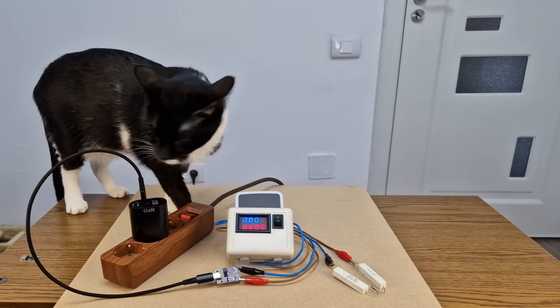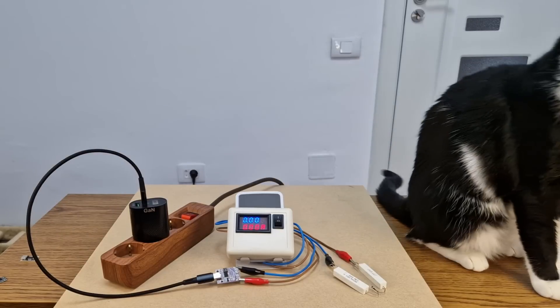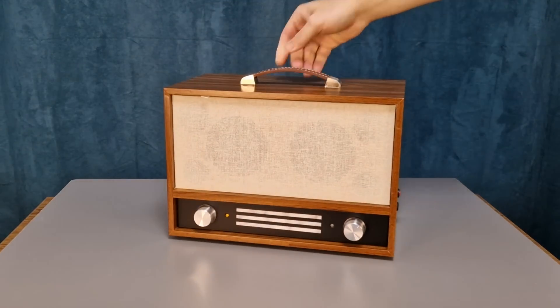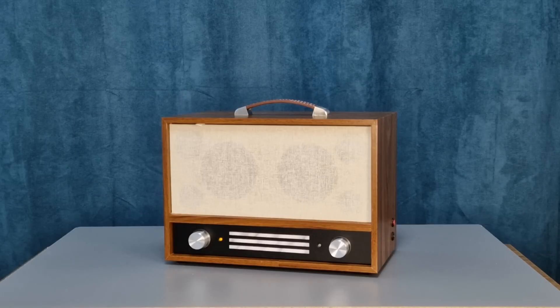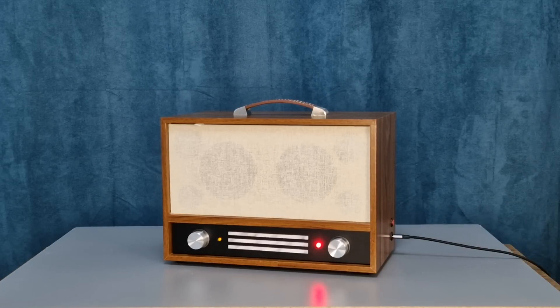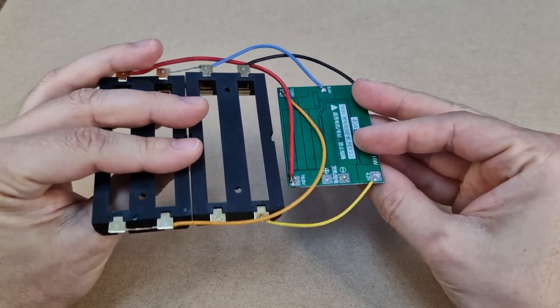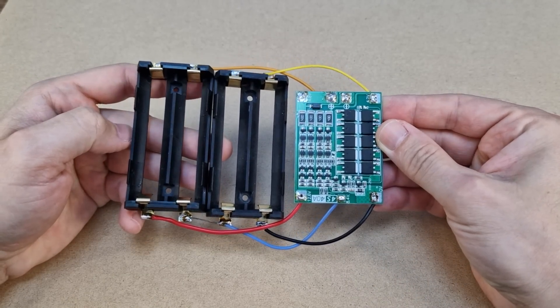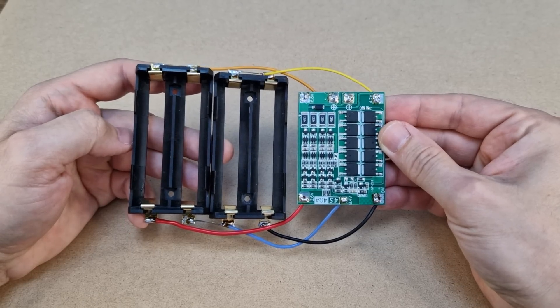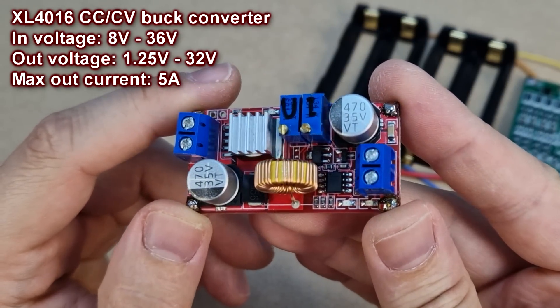But first, the health and safety checks — yep, everything is good to go. We'll start with something simple. Let's say you've built a portable speaker with a 4S battery pack and you want to charge it with a common USB Type-C cable using the power delivery protocol. I will use a 4S BMS board and connect the balance leads to 4 cell holders. But this lithium-ion battery has a maximum of 16.8 volts, so how can we charge it with 20 volts?